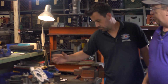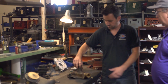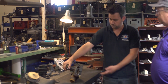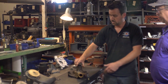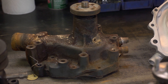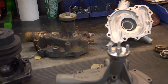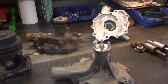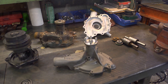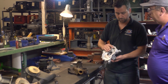Here's a great example — a pump that came off a well-used engine, obviously many years of use, dirty, grimy, bearings shot. I certainly wouldn't want to trust something like that. When we get pumps in like this, first thing we do is take a few measurements so we can put everything back together so your pulleys and fan line back up the way they were. We take the pumps apart, clean and degrease them. After degreasing, we glass-bead the housings and inspect them to make sure they're free of cracks or any other damage.